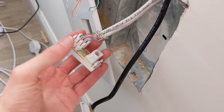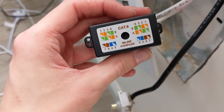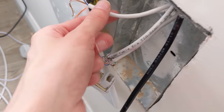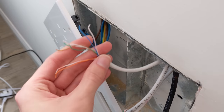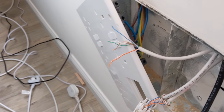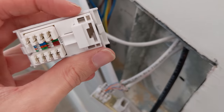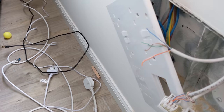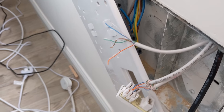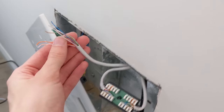What I'm going to do is use this little Cat6 coupler - it's just a keystone bridge, quite cheap, numbered on top with two colour schemes. I'll link the cable through here. I've also removed the existing network jack because it was really badly terminated, so I'll redo that. I'll use one of the new modules we've bought - the module here matches the one in the hall cupboard. So I've wired the two cables that used to go into the phone jack together using the coupler.